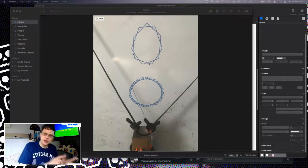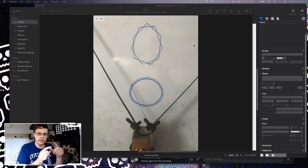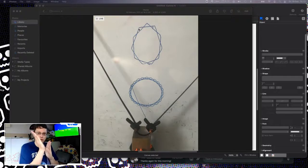I then swapped to a different library and tried adding acceleration control. The first diagram I had could only do 45-degree diagonal movements because I was stepping both motors at the same time — if I wanted an off-angle it would move at 45 degrees and then go straight at the end. So moving at non-45-degree angles was really important, and acceleration control was my next goal.